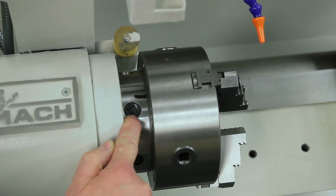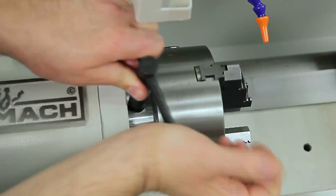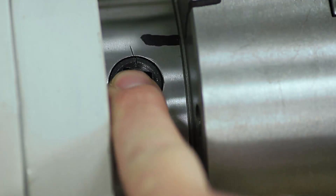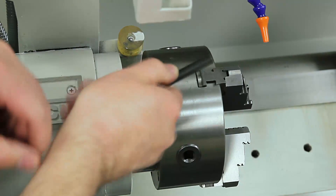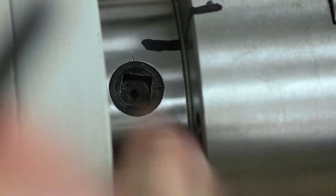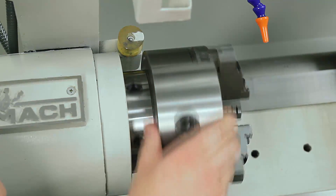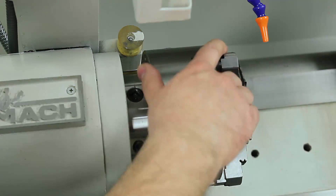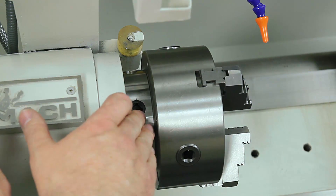It's hard to see, but the mark is right there on the cam lock itself. Rotate it up to the free position — that's where it's got to be to remove the chuck; it's got to be lined up at 12. Then you rotate it around and this is locking it in. You want that mark between 3 and 6 o'clock, so right there is where you want it to lock up tight. Check all the witness marks — this one's about 4 o'clock, and that one's about the same. So all those studs tightened down to the gauge line are pretty good on this chuck.